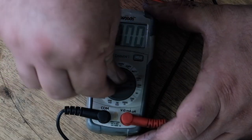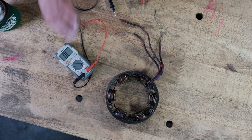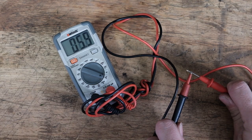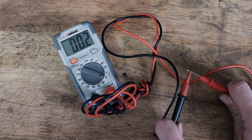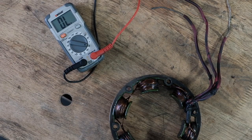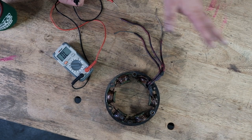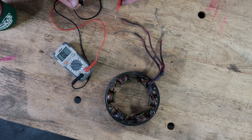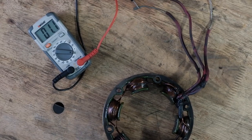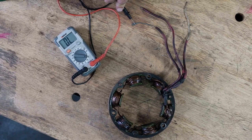I have a digital multimeter set to ohms on a very low ohm setting, and we're going to take some resistance values. First I'm going to test my meter to make sure it's working and see what my residual resistance is — it's about 0.2 ohms, just to know the meter has its own resistance value. I'm going to try to find the two wires that have the highest resistance reading out of the three combinations. Starting with this first combo — we're getting maybe 1.1 to 1.0 ohms. That's fine. I'm going to keep this one touched and go to this other one now — 0.5 ohms, so that's definitely less.